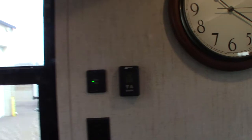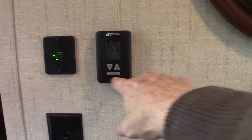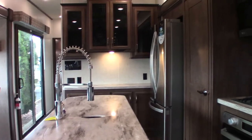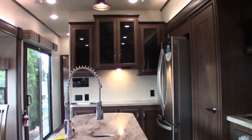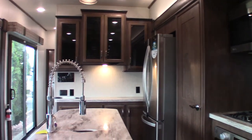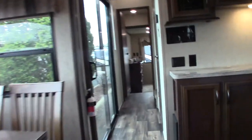The thermostat back here is pretty straightforward. You hit the mode button, which is the bar going across, and then you select fan — which is the air conditioner running without the compressor — or cool, which is the air conditioner, on low, high, or auto. You always want to stick with auto if you can. And then the next option is the furnace. That works like every other thermostat.